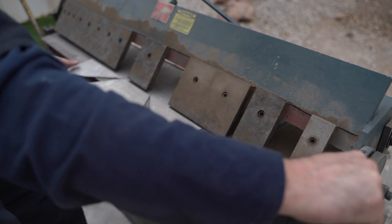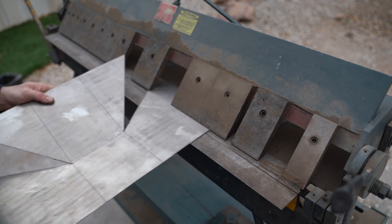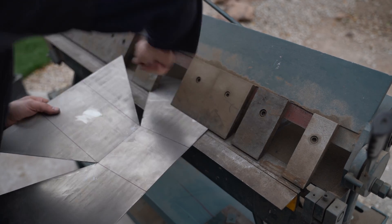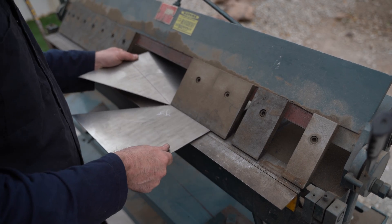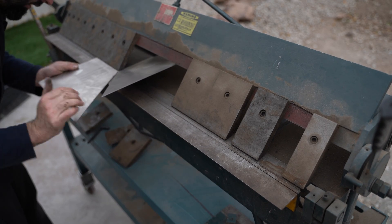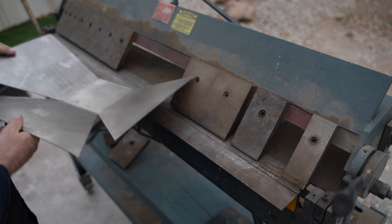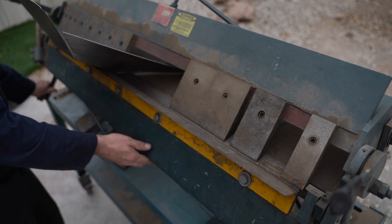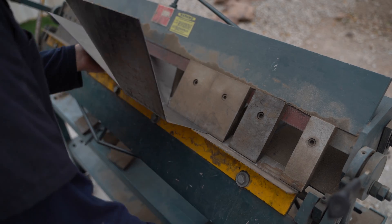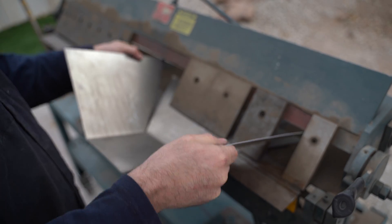Here's where I need some help. I'm going to shift from sharing info to requesting it. I know I have a few subscribers that are professional fabricators. I've had several sheet metal projects where I chose to create a trapezoid type shape in sheet metal just like the one I'm trying to make. This brake isn't having it. I have a feeling a magnetic brake could accomplish the job in several steps, but still would not be easy. Anyone have any tricks? On this brake I generally start the bends using my hands until it no longer fits the brake, and then I finish the job with a hammer and dolly in the vice. It works, but the perfection just isn't there.